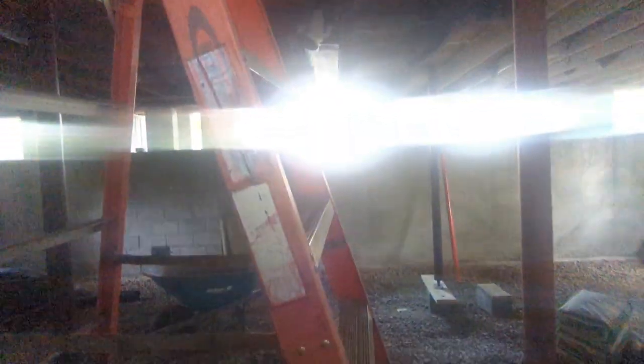And then if we're going to put a toilet underneath the basement stairs, it'll be a T here, and it would go straight through underground to the other side of this footing and immediately turn and roll up and be a flange here, which will put you under the high side of the basement stairs. Maybe over there a little bit, but we've got to plot out the stairs roughly to know if you're going to be under the stairs with a toilet. And then alternatively, we're going to come over here and bend and go that way.